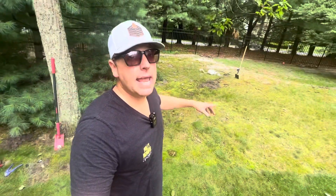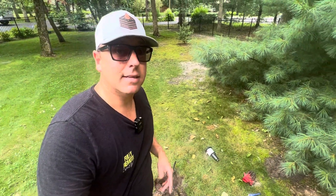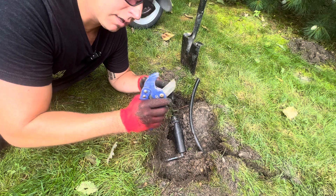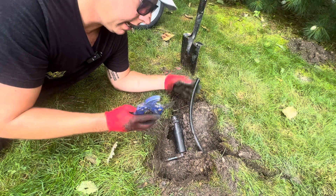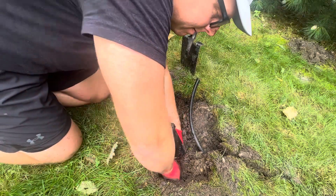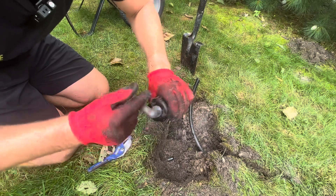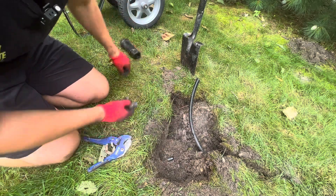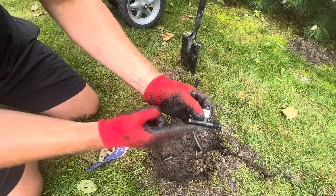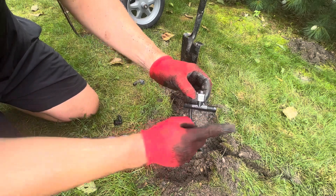Now the line is run. I'm going to make the connections where my original sprinkler head was and show you how to make up this connection. When you get to the bottom of your sprinkler, you're going to take your cutters — which you can get in the description below, they are strictly for irrigation cutting PVC and flex line — and cut that off. We're going to take this piece out and put in a tee. This tee — one side is coming from our water supply line, one side goes to the sprinkler head we just removed, and the third goes to our new sprinkler we're installing.